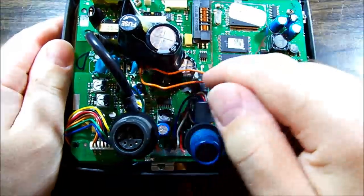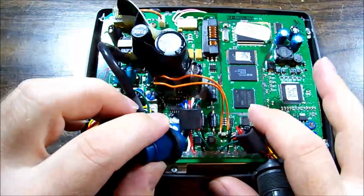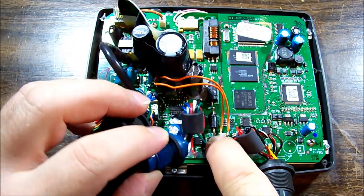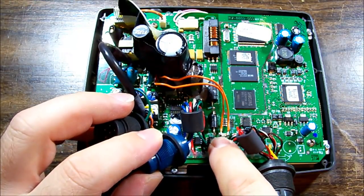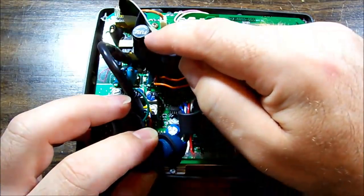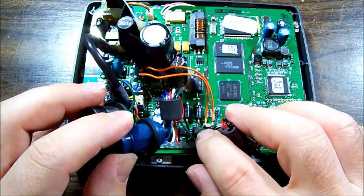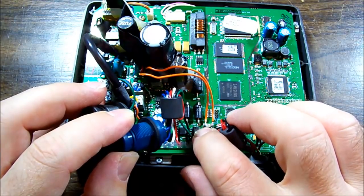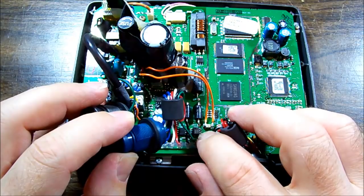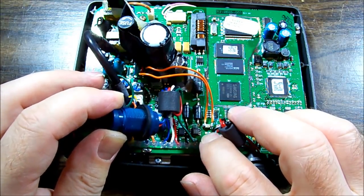These two orange wires are coming down, and they come down to a surface mount fuse and are soldered directly on top of that. So either that fuse has blown once before and they've replaced it with a user serviceable part, or in the factory they realise that that isn't going to cut it. But no, there's no way they'd do that. Somebody's done that on purpose. Somebody has done that on purpose.